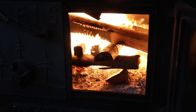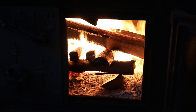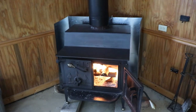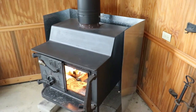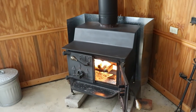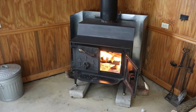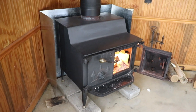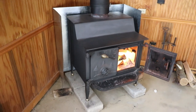You may have to adjust the flue again — the key point is shutting the heat back into the firebox so the heat comes back into the room. I grabbed a piece of sheet metal to put behind the stove. It's installed to code — I believe 12 inches from the corner of the wall — but I felt it might get a little too hot without extra protection. I bent some cheap sheet metal as a backing, and when the stove is fully going you can touch the sheet metal and it's barely warm.